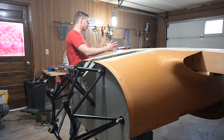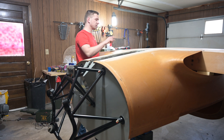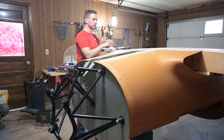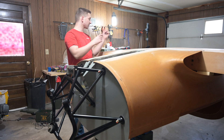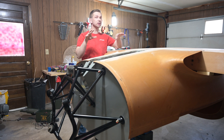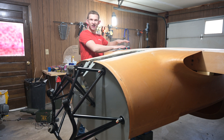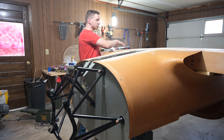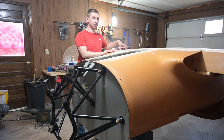I'm at the point where I'm going to make the rough cutout of where I want the gear doors. I'm then going to transfer that pattern to the inside so I can make sure that the gear is going to clear. They have a drawing showing a larger gear door cutout area that's recommended if you can swing it, so I'm going to try to make those doors about as big as the plans will allow and make sure everything clears. I think that's a better way than what Lancer says, which is to just fit the gear itself to the doors.